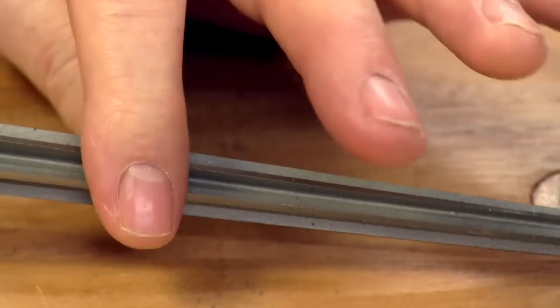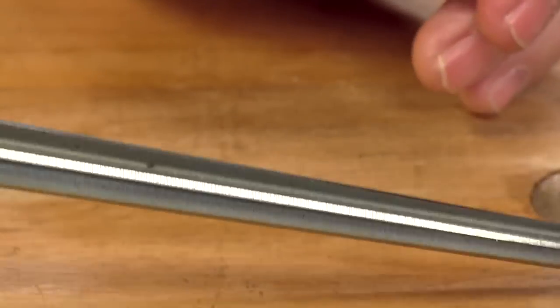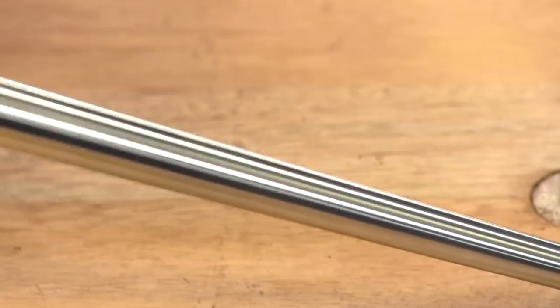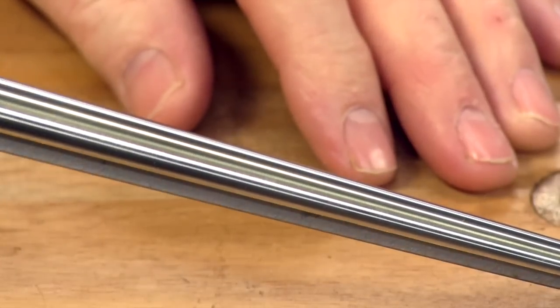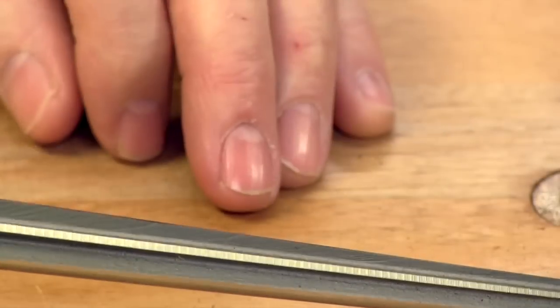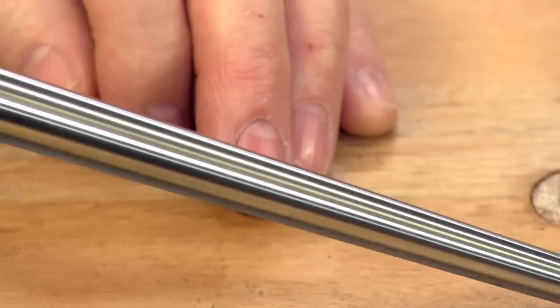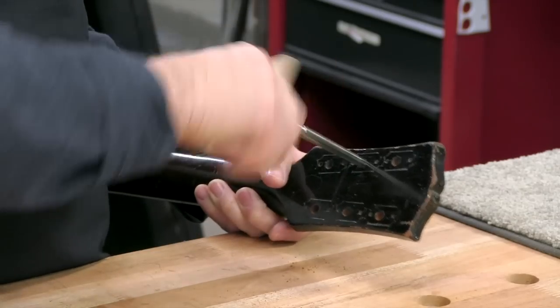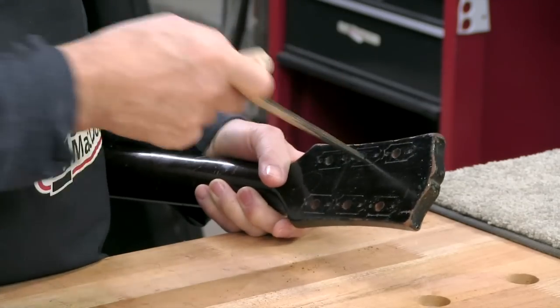Unlike utility reamers, these peghole reamers have cutting blades on only one side, and the other side is round. That rounded side keeps the cutter centered in a hole, so when they ream a hole, it stays truly round. Utility reamers have blades all around that will hog into the wood. The hardwood handle has a good shape to it and feels good in the hand when you turn.